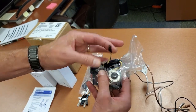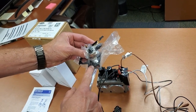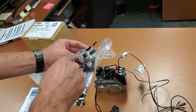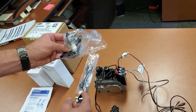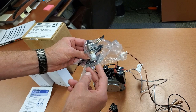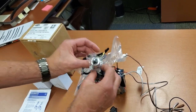It's got a wire plug. Just like tightening lug nuts when changing a wheel on a car, get it snug and then go around back and forth so it's nice and even and compresses the gasket. You want a tight seal but don't over-tighten it — it's an aluminum valve and you could strip it. Get it nice and tight to compress the gasket so you don't have a gas leak. Now your motor is on there.